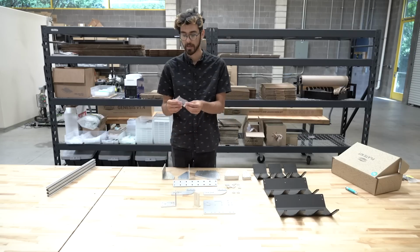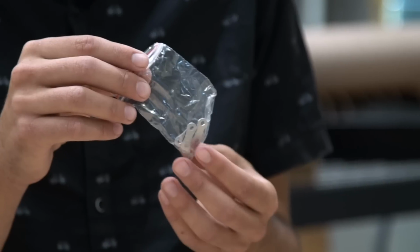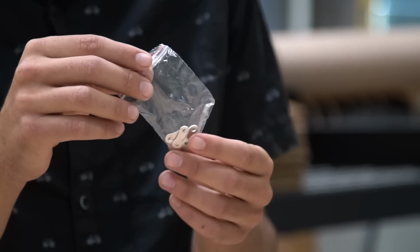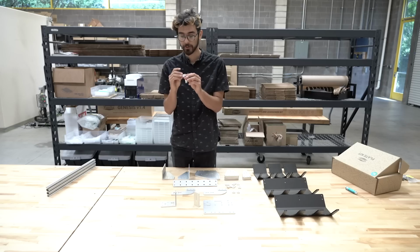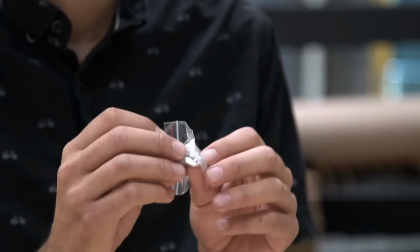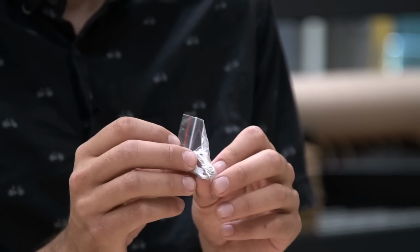Last in the plate kit are the jumper links. These may be easy to miss, or you may be looking for them in another part of the kit, but they are in the plate kit. The jumper links are used to connect 2 of the electronic screws on each of the tools to allow the FarmBot to be able to detect if the tool is mounted or not.